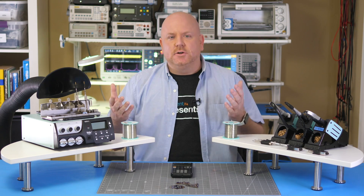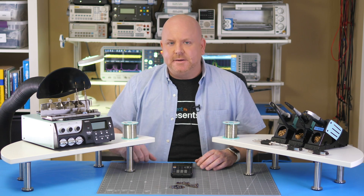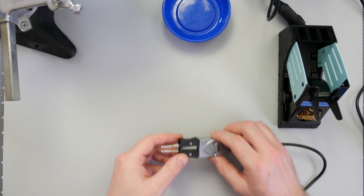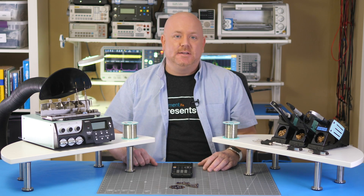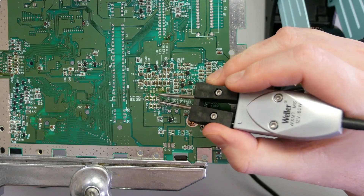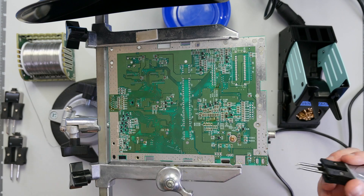You're thinking: sure, that's great, but what does this have to do with your calculator? We don't need to remove any ICs, we're just changing a component. Weller has a very cool tool for removing two-terminal surface mount components — check out these tweezers, they're called the WXMT. On the tips are teeny tiny soldering irons. Like most things in the WX family, the tweezers are interchangeable with different sizes for different sized components. Let's go back to the Super Nintendo board to practice removing capacitors. Once up to temperature, it is just a matter of grabbing the components. The only annoying aspect is that they tend to stick to the tip, so I used a light tap to get them to fall off.